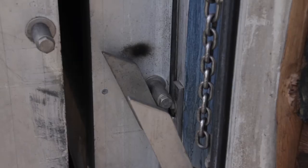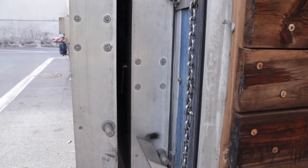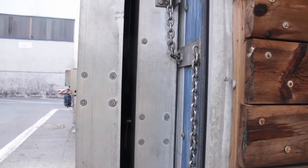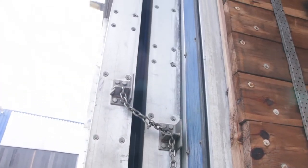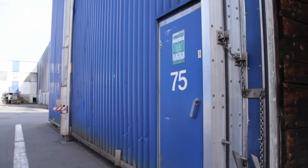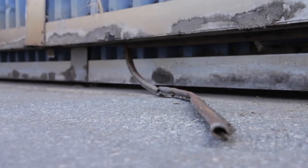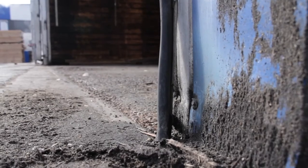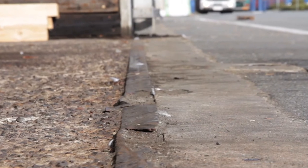The doors of the drying chamber are provided with seals that are pressed against the door frame by the dead weight of the doors. For a good seal, the suspension devices on the doors and on the door frame must be correctly aligned. The seals must also be functional at all points. Defective or missing seals should be replaced immediately. The gate is placed on the chamber floor by its own weight via a seal.